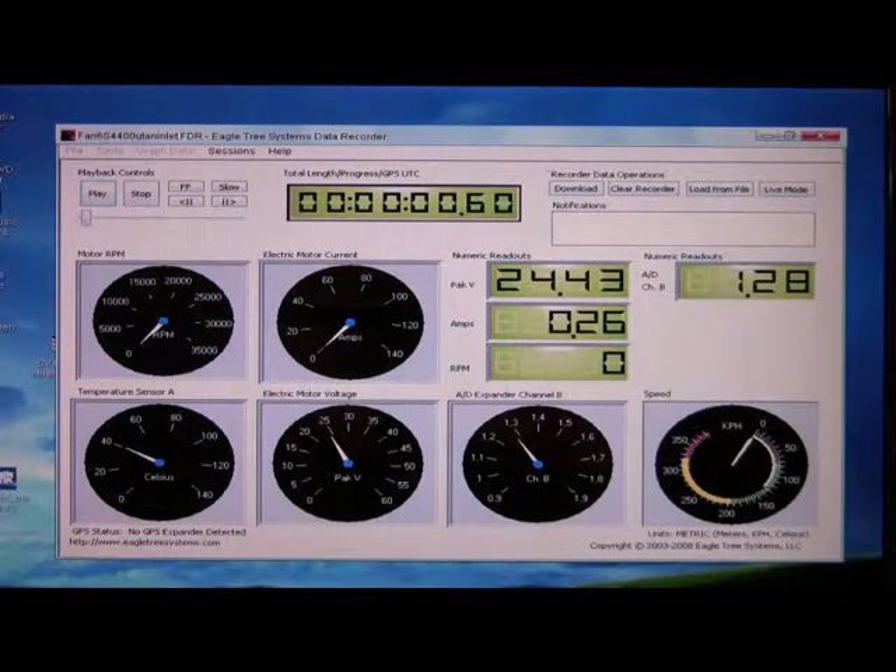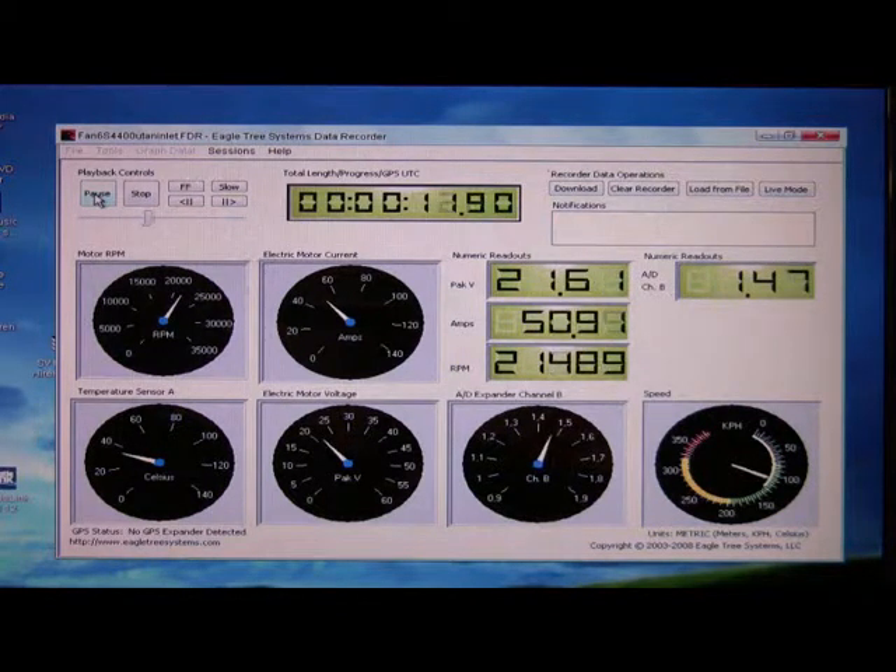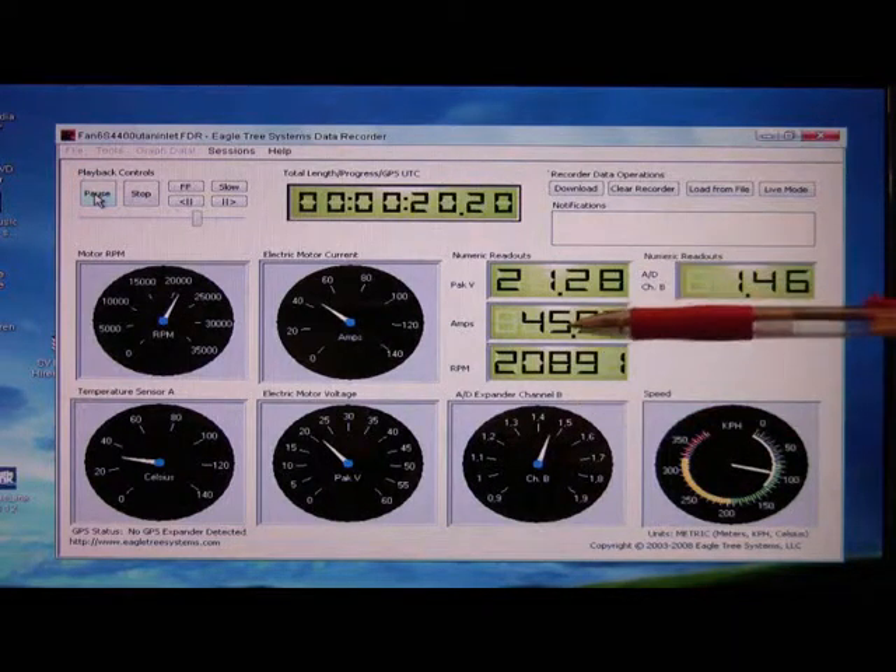In this first file we're going to show, it's zero kilos when it's 1.28 there, and it's going to come up to 1.48, and that is equal with 1.56 kilos. I will start here to play this file. You can follow the ampere draw. Now it starts rotating a little bit, and then I stabilize for full power for a short while. Here you can see just the value, but it's equal to 1.56 kilos. And you have the RPM and voltage and the ampere.